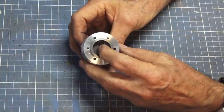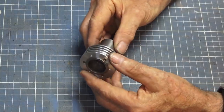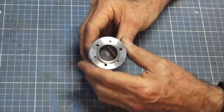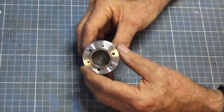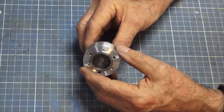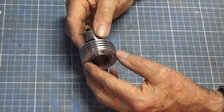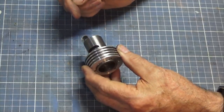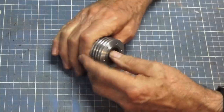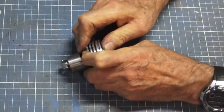And you can see here that the crown of the piston is starting to come right up to the top of the liner. So in the notes, it says that you try to arrange this so that the fit gets tighter toward the top, which was what we've got. And I've been talking to a gentleman named Don Brimer, who's built one of these engines, and he said that he's made his piston so tight that you basically got to put a stick in there and push it back out again. So that's how that is at the moment.